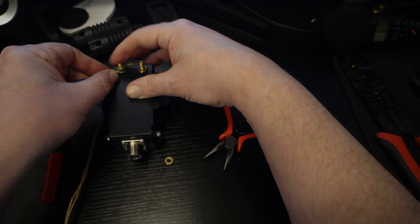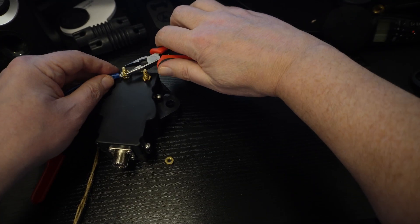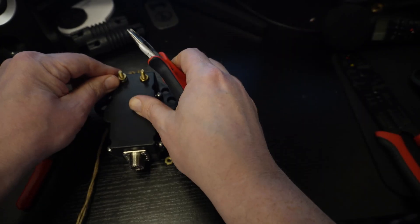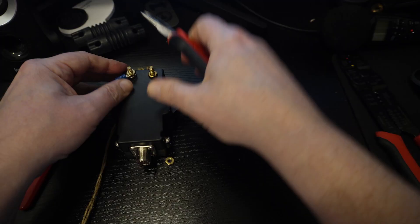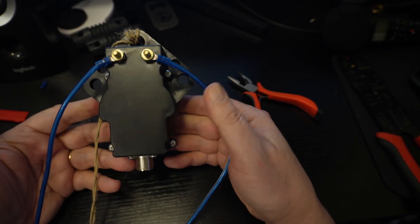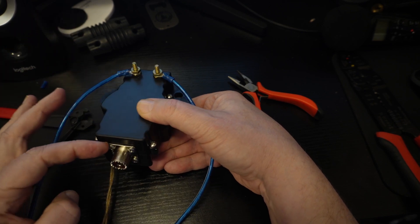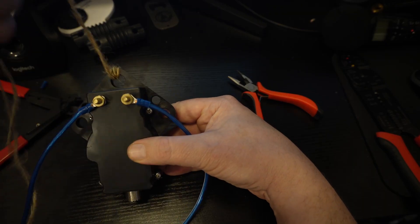I had to take this apart and tighten things up a bit. Get that on there, then maybe take some needle-nose pliers or the right wrench — and just tighten that a little bit snug, not overly, because this is going to go outside. This wire goes there, that wire goes there. You'd see on the inside that the center conductor goes to one terminal, and the other wire goes to the outside of the SO-239.